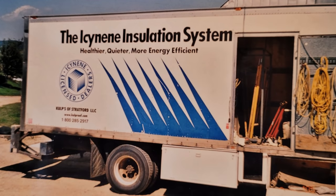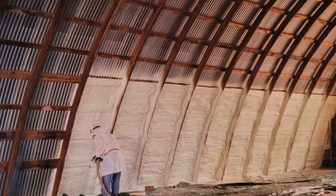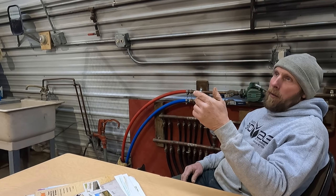And then the same company came up with this one, this polyfoam. It's been a while now since we did this, so I'm trying to think back on all the specifications, but we could get the same R value at 3 inches, and this stuff hardens to the point where you could walk on it, you'd have to use a claw hammer to remove it. So it was a very good product. This would add strength and rigidity to the building, almost like a bonding to all the metal and all the wood, filling in all the cracks. That was quite a process, but they wanted $13,000 for this product. I said, well, is it flammable? You start brainstorming, thinking, we're going to spend all this money, and how is it for longevity and all that type of stuff?